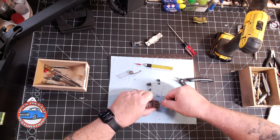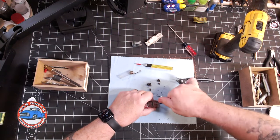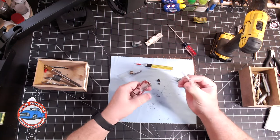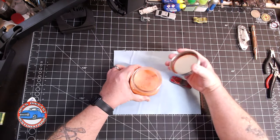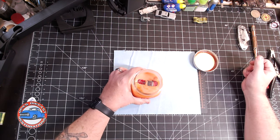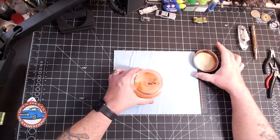While this video is not a Bright Vision video, a lot of Bright Vision stuff is going to happen here — we are going to use the new Bright Vision Hot Swap hubs, but we're also using their little tap handle. I've had some people say it's too delicate and small and doesn't hold together well. Pooey to that, I say, because this thing is fantastic for this light little job. We're not tapping out a hole for a rivet on an ocean liner — we're tapping a little 2-56 screw hole. You get some big, lunky thing, barely get it started, let go to reposition your hand, and the weight of it pulls it out of the hole. I love their Bright Vision tap handle.